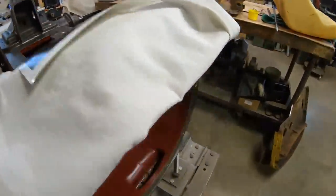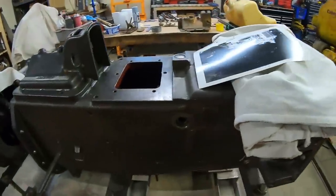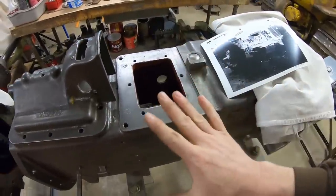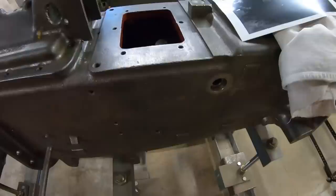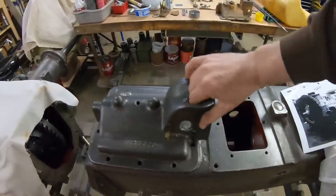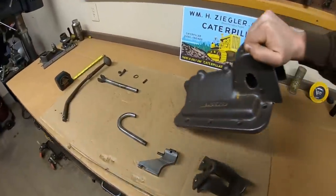And we know from prior episodes that was for an early vertical style engagement yoke for the overcenter clutch on the front of the torque amplifier before they went and drilled and then welded in the bungs for that horizontal, more like the production version of the clutch engagement for that Amplitorque. So it could have been an interlock that would have run down the side, intersected with that. It's all just speculation at this point, but this is part of the fun of prototype tractors.